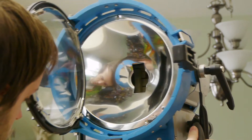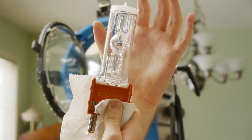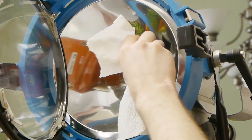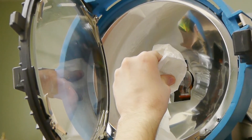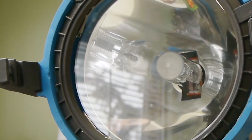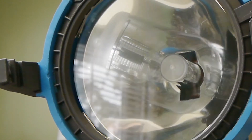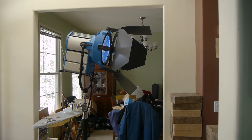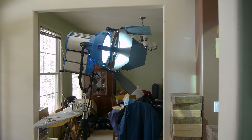Here we go opening up and looking at that beautiful reflector — it looks like a really solid reflector. Here's the nice UVS bulb in great condition, looking like it had only been fired for testing purposes. You just slide it in there. In my experience with this unit, you do want to experiment with which way to insert the bulb, because sometimes if you put one cathode or anode on the top or bottom, it will lean one way and might scratch on the reflector, so do be careful. Here's our first time firing it up — it worked really solidly. You have your normal green cast coming up, and eventually it stabilizes to a really nice daylight temperature. It takes a couple of minutes — about your average time an HMI lamp takes to come to temperature.